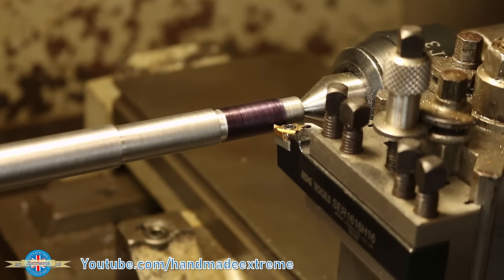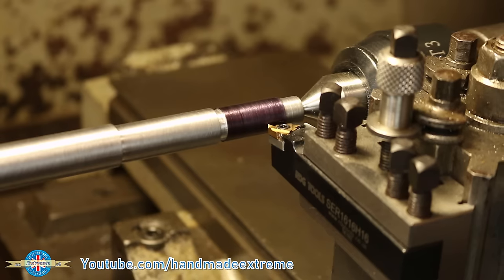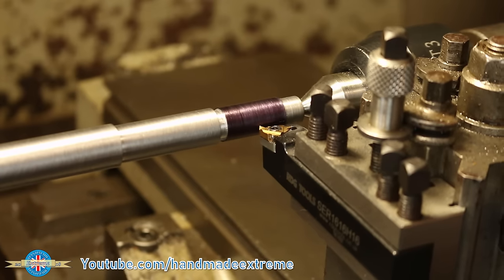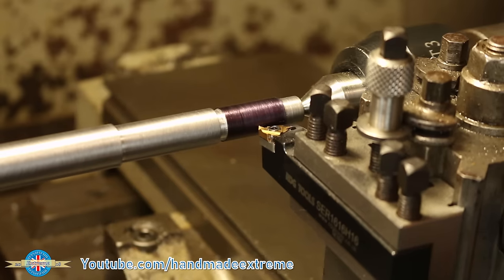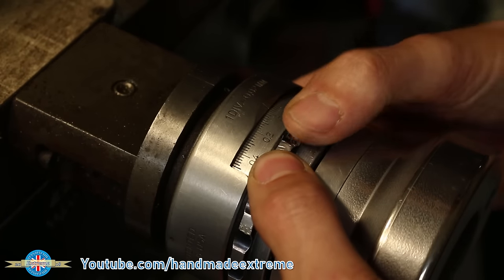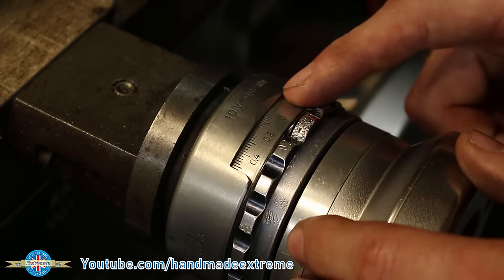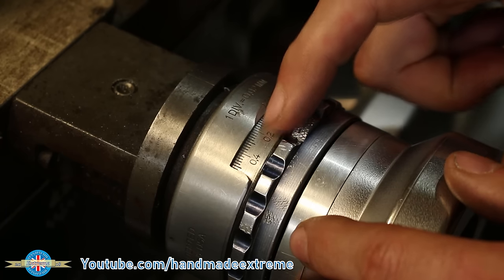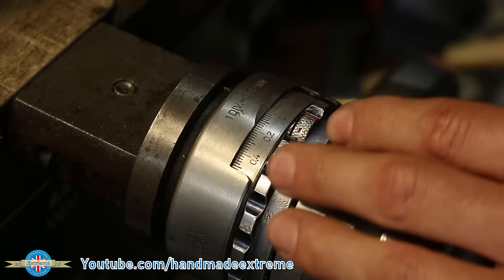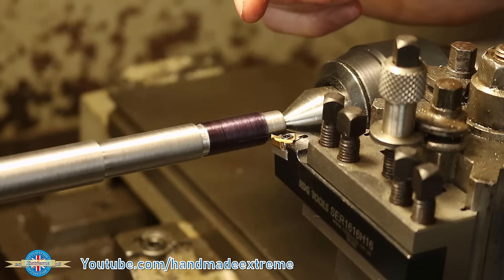The next step is to just bring the tip of the tool into contact with the part — this is going to set your datum. I like to move the tool back and forwards along the Z-axis so the tip scratches a line into the inked surface; that way I'm just touching lightly and not gouging in too far. We then want to zero out and lock the dial on the X-axis — this will be our depth of cut, starting at zero on the surface.